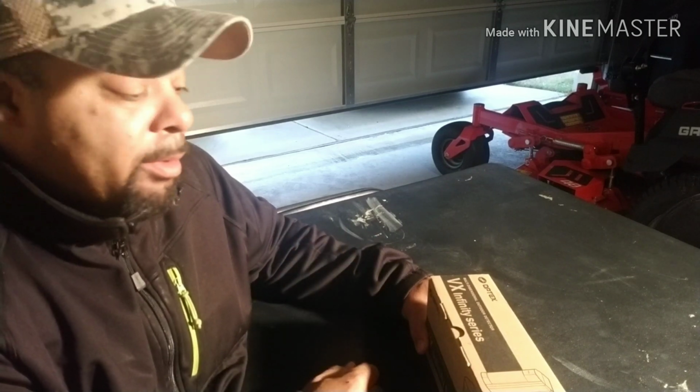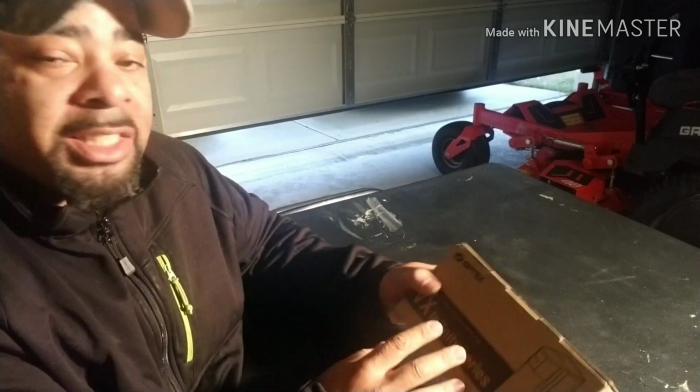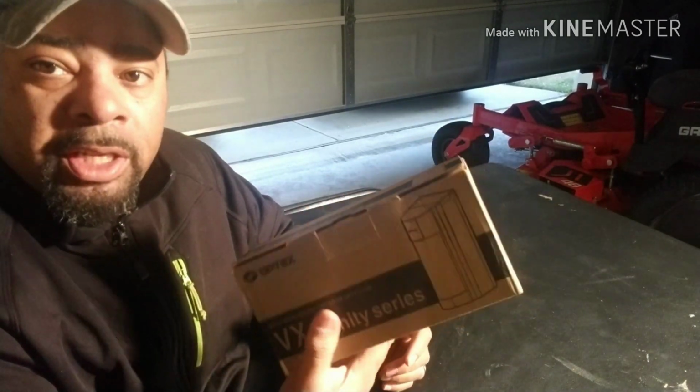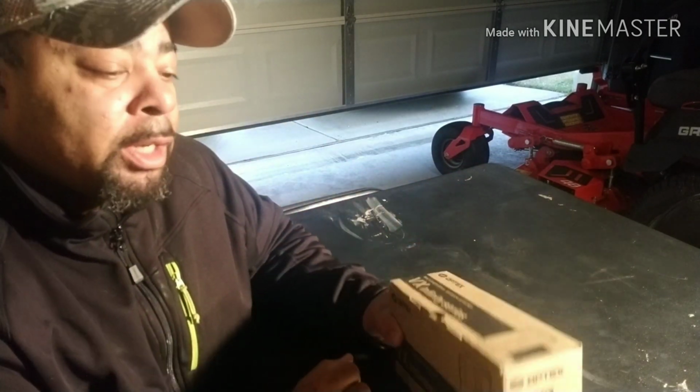And I got another Optex product that I'm going to try out that I picked up from my supplier. This is a wall mount unit. So you want to mount it between around 3 feet to a 4 foot area, flat on the wall, as always, level to the ground. This is the VXI-DAM. So it's PIR with the microwave. Also, those are the units that I prefer.